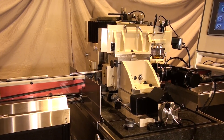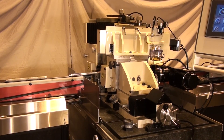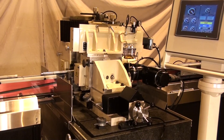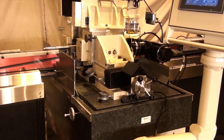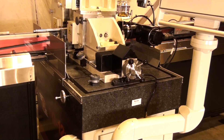This design gives the grinding wheel spindle superior accuracy. The regulating wheel, with its 2.25 inch (57mm) spindle and Timken bearings, allows for the most demanding applications with zero deflection. The 8-inch diameter regulating wheel allows for closer tolerance with larger diameter work. The machine sits on our 8-inch thick, surface-plate quality granite with 2 tenths flatness, forming a perfect platform for such a robust spindle design.